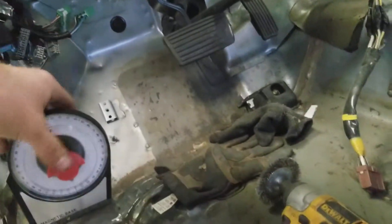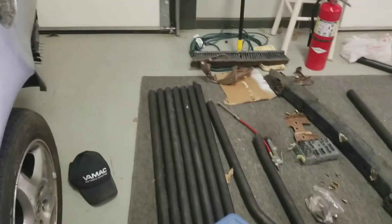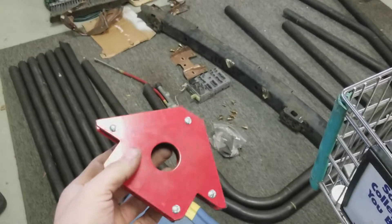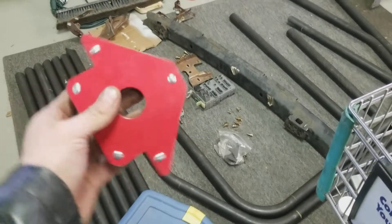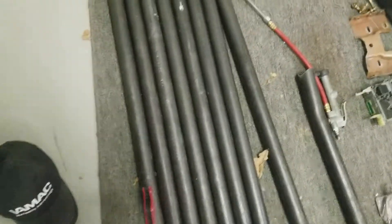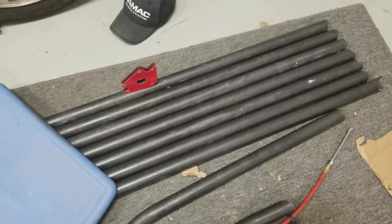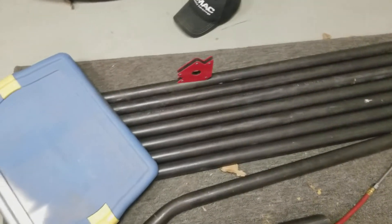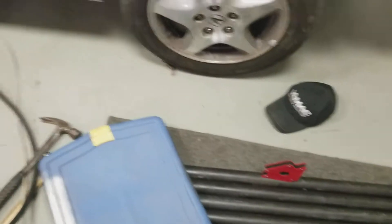As far as the roll cage goes, you just use the big red magnets - I bought four of them. When you need to support a piece or hold it in place so you can mock up the other one, you just stick this right onto the bar and then put your other one against it in whatever direction you want. It kind of holds it. When I was building the boxes with it, it was strong - it was tough to move around.